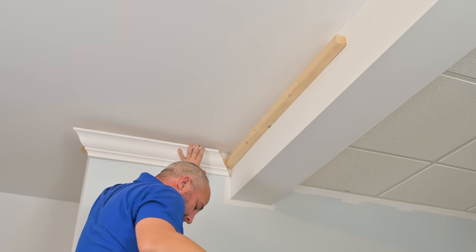A little bit of caulking on the joint down here. Generally speaking, I'm not a big fan of using caulking in nail holes — you can use Drydex or 45-minute compound, mix up a drywall powder, and use that to fill all your nail holes. When all of your caulking and putty work is done, you need about two hours for it to dry. If you're doing a whole room and you do the caulking and putty as you work your way around, it takes about two hours — so then you can take out your paintbrush right away and start painting all your trim. This is just primed; it probably needs two coats of a finish trim.